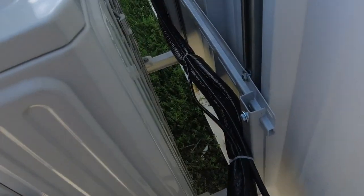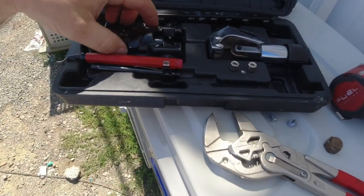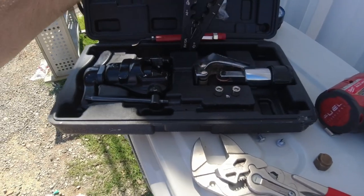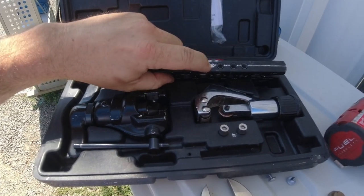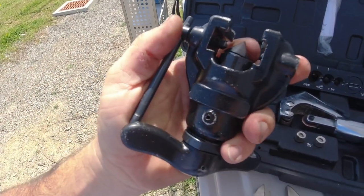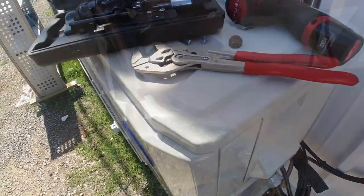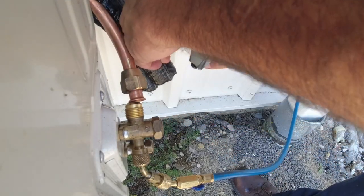So my Mastercool eccentric kit — that's the part number there. It's not a fancy tool kit: deburring tool, cutter, nice simple flaring block. I've screwed up and punctured the wrong side twice, but it does a good flare every time. It's eccentrical, meaning it wobbles. It's not rocket science, it's been around for a while. They say when in doubt, cut it out — so just cut this little piece off here and we'll just start over.